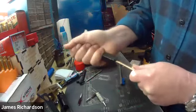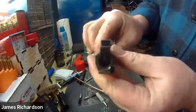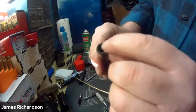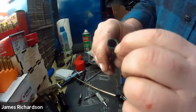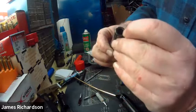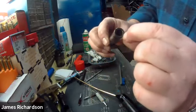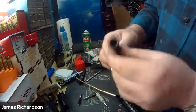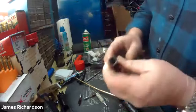You also inspect that barrel. Can you see the lands and grooves? You don't see any chunks visible in there. You also want to inspect the crown. Anytime you're working on a gun, this is the crown of the barrel — you want to look for chips and gouges and cracks. What happens is these things will bang into stuff and it will really affect the accuracy of your gun. If this portion of the barrel gets dented or cracked or chipped, it can really wreak havoc — especially with rifles. But you can get them re-crowned. It's not the end of the barrel — you just need to keep an eye on it.